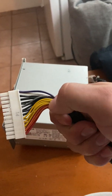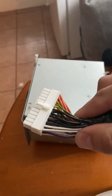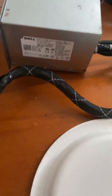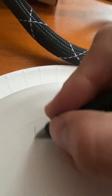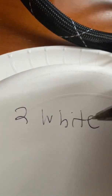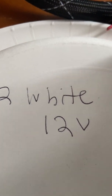All these yellow wires must be connected to 12 volts or this will not work right. If you see whites on it, the two whites are also 12 volts. You're gonna have to hook up all the 12 volts together — white to white. You'll see one red wire which is five volts.